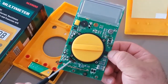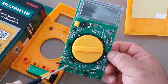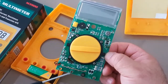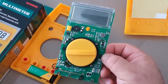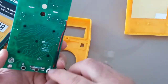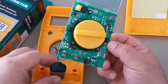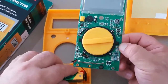You can see down here you've got a coil — I'm not sure how that relates to the input protection; I haven't seen that before, but that's very interesting. Another resistor array down here. It says two amp, 250 volts. And there are zener diodes. On one side it's extremely sparse with a simple little glass fuse, but on the other side it looks fairly well made — more than I was expecting. The nine volt battery it shipped with — we're going to get rid of that awfully quick.